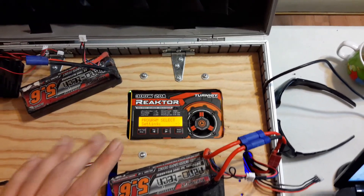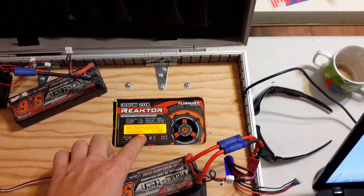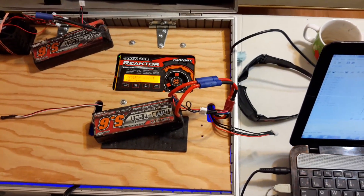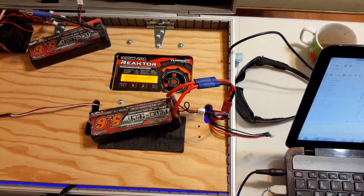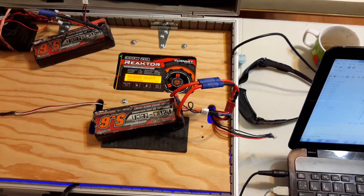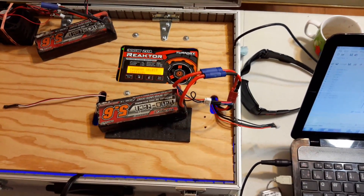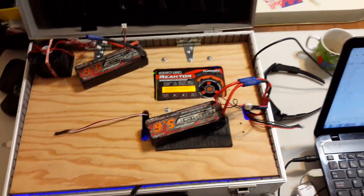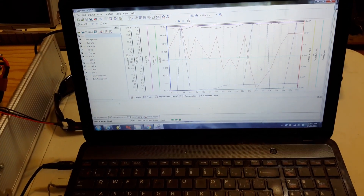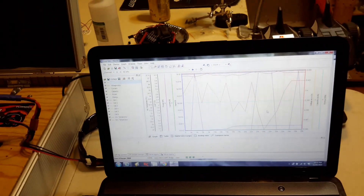We'll post some links in the description. Maybe not right when this video is uploaded but shortly after I will get to the editing part, so check back for that if you're interested. Overall it's a very good charger for the money — I think I paid 60 bucks for it and it holds its own. I love the fact that it can charge these nanotechs. I don't really like charging over 2C but I'll sometimes go up to about 3C with these packs, 15 amps, and it charges them pretty quick — about 10 to 15 minutes and you've got a fully balanced, charged pack ready to go. The LogView program — this is V2.75 — you can download that anywhere. So we hope to see you again guys, thanks for watching.